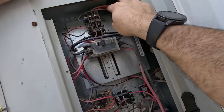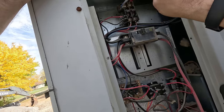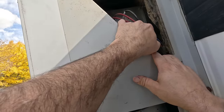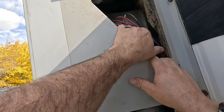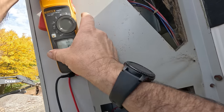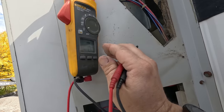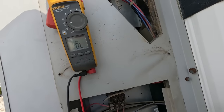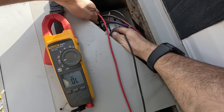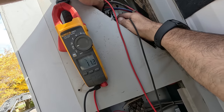The two reds are going on up. Now what is this blue wire going to? That blue wire actually goes up there to the limit switch. So they are using the limit switch to shut down the contacts. Let's go ahead and check our resistance on our switches and on our elements. They should have somewhere around maybe 10 to 14 ohms. One leg's broke so we're fairly isolated. Going leg to leg - this is just elements - 12, 11.5, 11.2, whatever. Coming over to the other - 12 ohms, something like that.